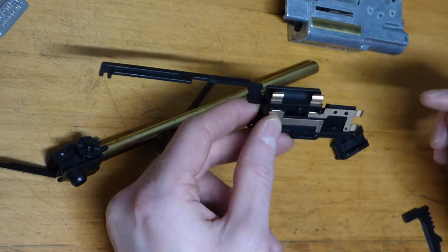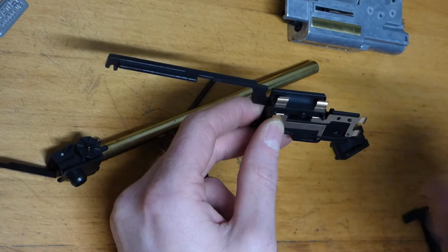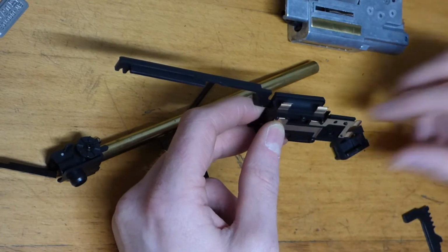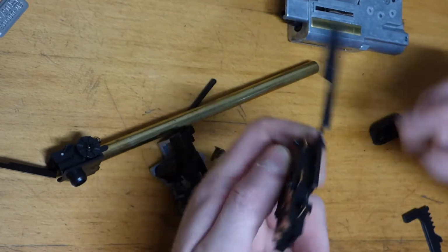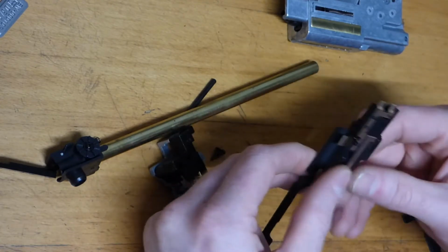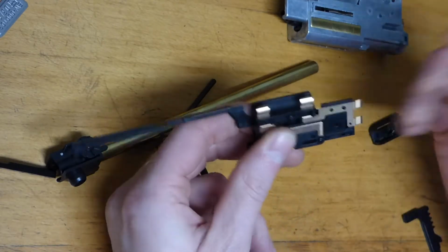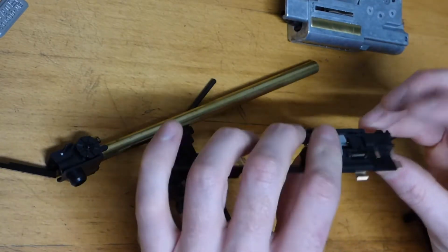And then I'm just going to utilise these areas where the fuse is to get some cables to run straight to the battery, which we're going to have on mini Deans connectors, so we should be able to utilise normal style batteries within this gun, bypassing the completely unique battery terminal that is in these as standard. So I'm going to butcher this.